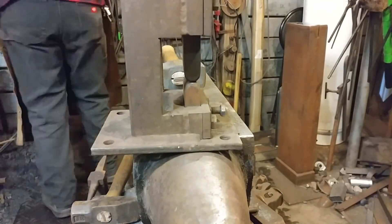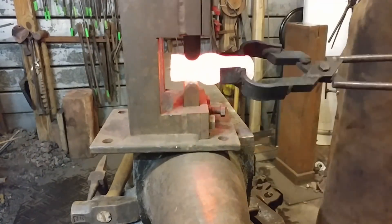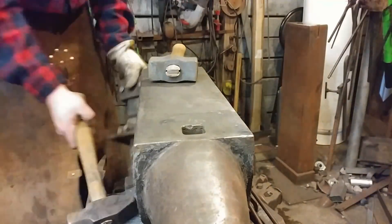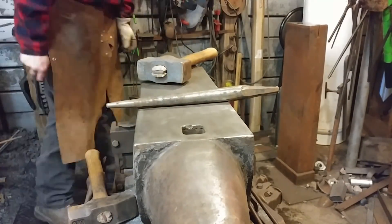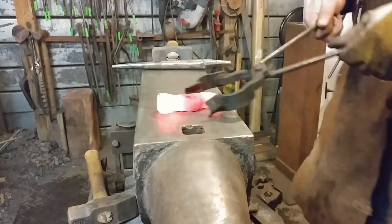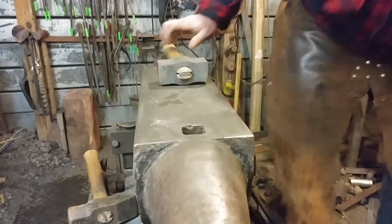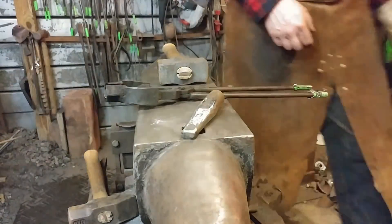This also means I won't be heat treating this hammer — first because I don't know the specific type of stainless steel it is, and second because stainless in itself is tougher than regular steel. Since even mild steel is tougher than copper, stainless ought to handle it just fine. Not everything in the shop needs to be hardened to glass and then tempered — but enough of that little rant.